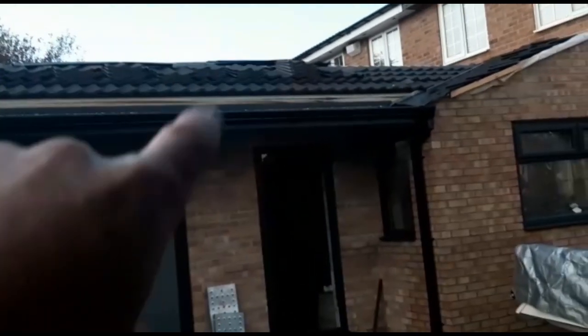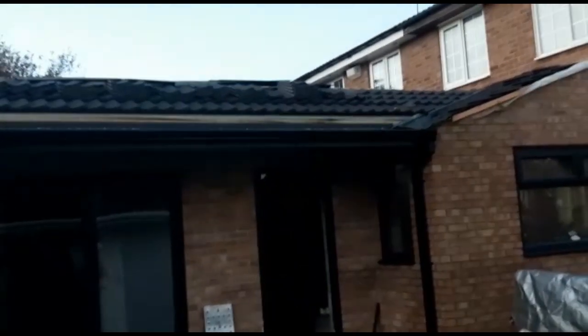I've actually tiled as much as I can on the back side as well. So I'm ready to bring more tiles up from down here, to pass through where the Velux is going to go inside. Probably next weekend, if I can round the troops up again, that would be fantastic and I'll be able to get the rest of the tiles on. I've still got that bit of the valley to do on the other side as well with that lead flashing, so I can finish off the main valleys.